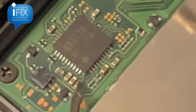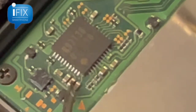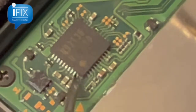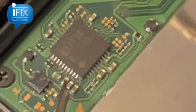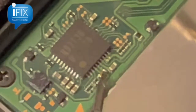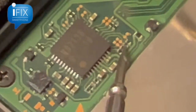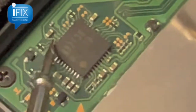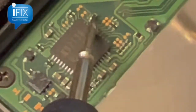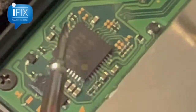This line is short to ground — this cap is not shorted but there is a short to ground. There you go, this cap is shorted. This one is shorted on both ends — you can see the trace that goes right in there. I'm not sure if the capacitor itself is shorted on both ends, it could be the reason. These are small resistors here. This one's shorted too, so we already know three lines right here are shorted to ground.